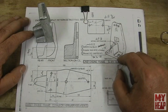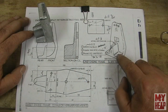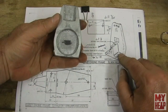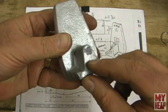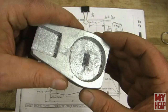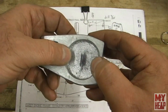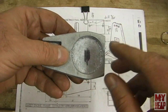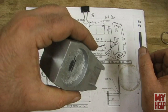The only other thing is to drill the holes for the mounting feet and give a spot face on them so you've got a clean place for the nut or bolt to sit. After I faced it off, I measured out 24 millimeters and figured out where it came across the casting — that side looks okay — but on the other side it doesn't appear to be centered in the recess for the flywheel. Since aesthetics matter, I measured and it's about 41 millimeters, so I'll set my height gauge for 20.5 millimeters, mark across both sides, and do my centerline.